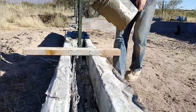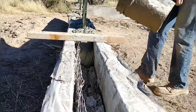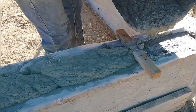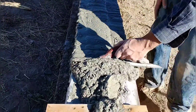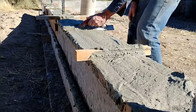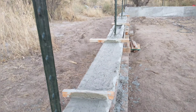After making the samples, we made one more full batch to try to finish filling this section of the wall, and it didn't turn out well — it was really, really bubbly. We went ahead and put it in and smoothed it off, and decided we would try again once we reset the forms for the last section of the wall. We did end up seeing some settlement on our batches too, unfortunately. Both the wall and our test samples settled some.